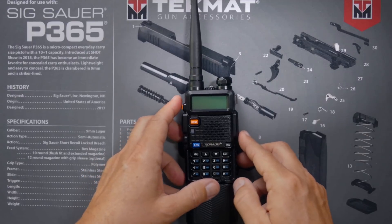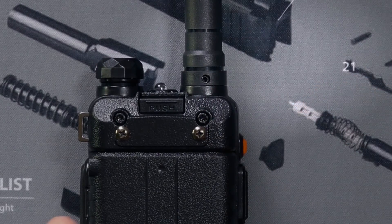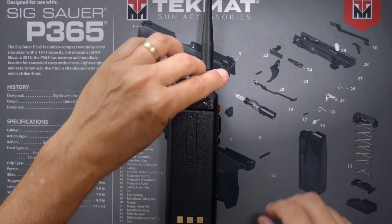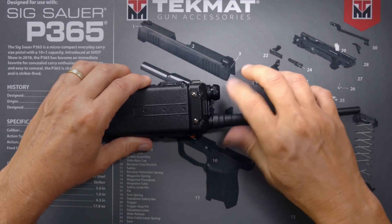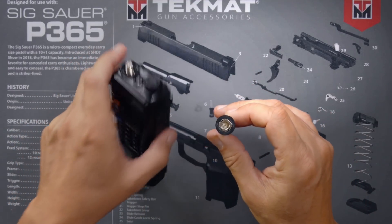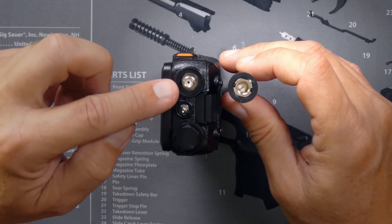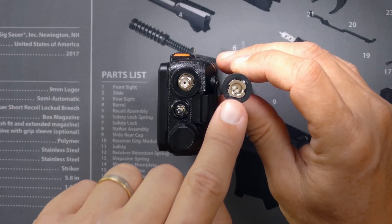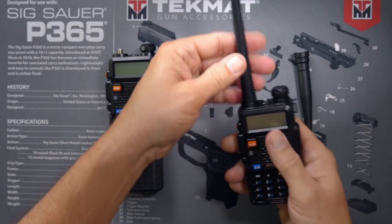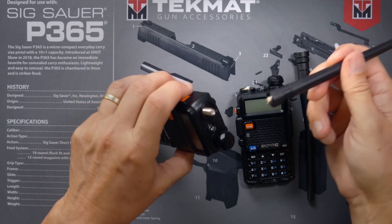The antenna on the GM5R is removable, but it has a set screw — probably to keep it from falling out in the field — and it is easily removable by simply loosening said set screw and untwisting it. One thing to note is that the antenna connection on the TID Radio is reverse from a Baofeng UV5R: it has a standard female SMA connector on the radio and a standard male SMA connection on the antenna, which is opposite from a regular UV5R. So UV5R antennas are not compatible.